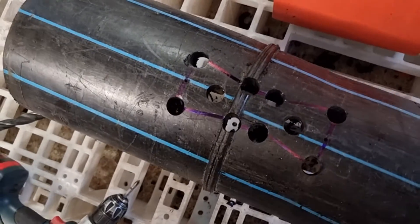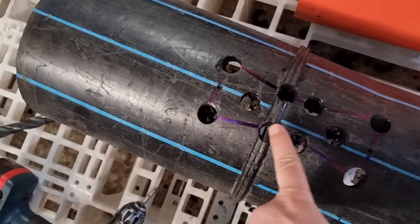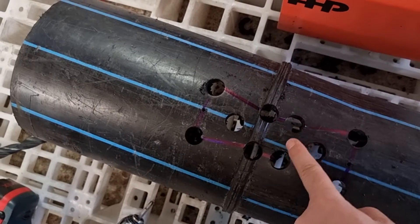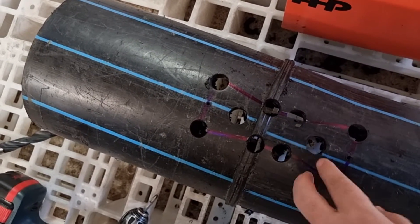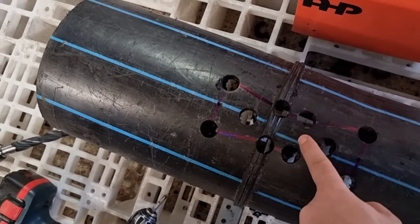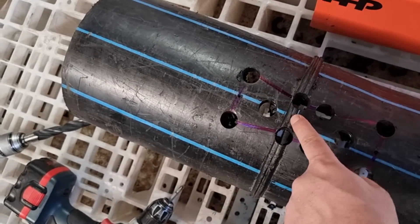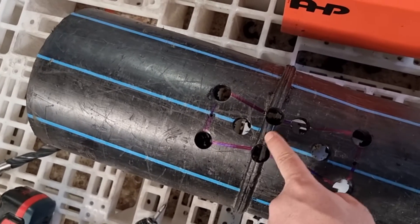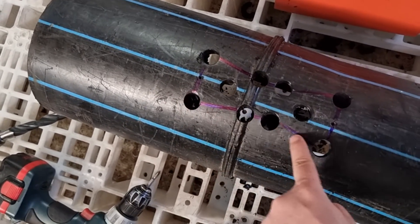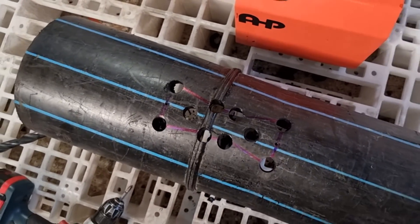As you can see on the sample, there are two reduced cross-sections: one is for the butt weld zone and the other is for the pipe itself. Based on the requested standard, this reduced cross-section is approximately 85%, 90%, or 95% of the butt weld zone cross-section. We will cut along the marked directions and obtain the sample for the tensile test.